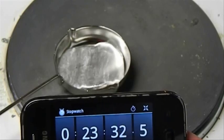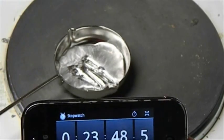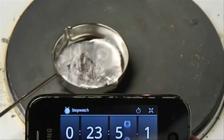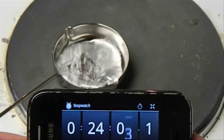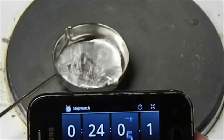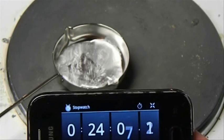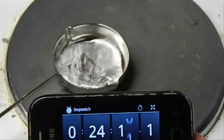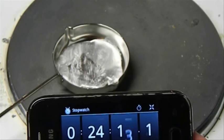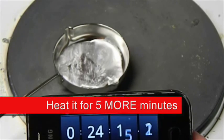You do not want the metal to be just gooey — you want it to be completely runny, almost like water. Comparing that to model metal, it takes up to 24 minutes before your five star metal has completely melted from a cold ladle. Of course, if you have a hot ladle or already have hot metal present in the ladle, the five star metal will melt a lot faster.